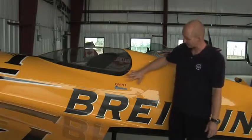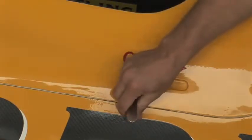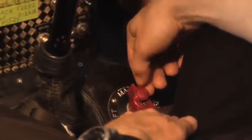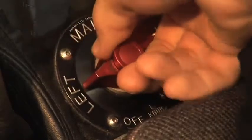To open the canopy, push in the centre, which will bring the handle up, turn the handle down, and then lift the canopy up. The airplane can only be opened from one side — the labels explain that. Same deal: turn the handle down, open the canopy up. If you need more room for the canopy, the lanyard can always be cut and it will allow the canopy to go further over to give you more access.